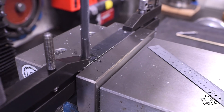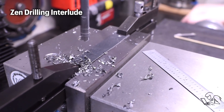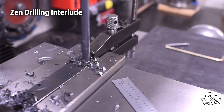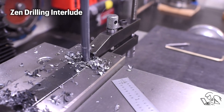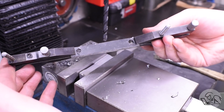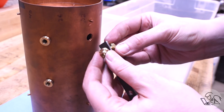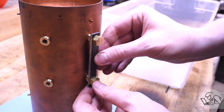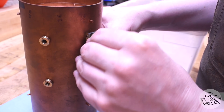That went well except I completely botched the centering of those holes - I don't know how that happened. After deburring, let's do a test fit on the boiler. The idea is I can use those plugs I made to retain the fixtures in place - the plugs also help protect the threads from the heat of silver soldering. You can loosen the plugs a little bit and just let the bushings find their center, then tighten them back up again.